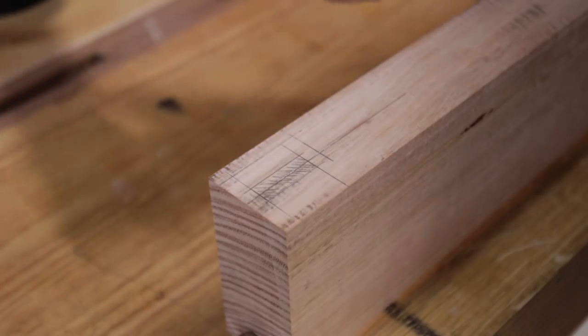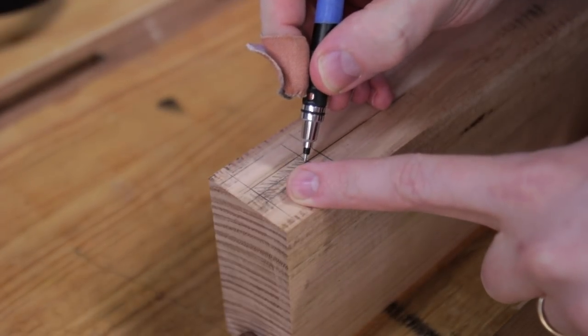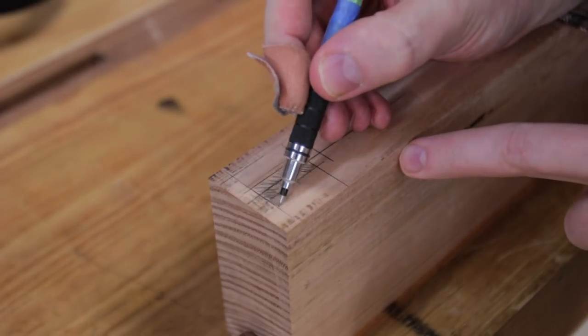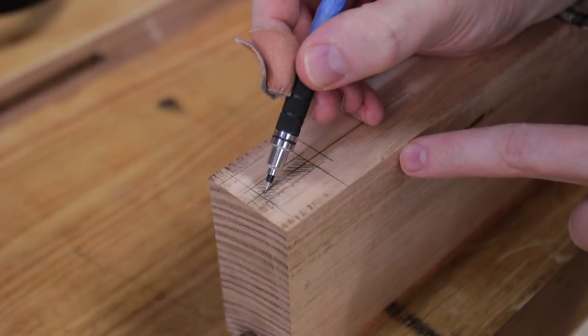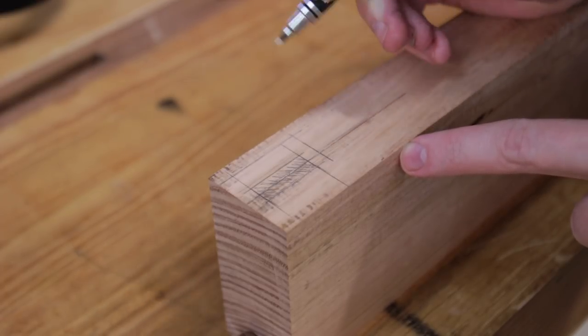These are a little bit more expensive than a standard straight cutter, but nowhere near as expensive as a spiral upcut bit. For this demo I'm going to be mortising this piece into this piece, using a 3/8-inch spiral upcut bit. I've got my centerline here, which is what I've centered my edge guide onto. This is my start line and this is my stop line — I'll plunge to full depth at those two points, then work my way through the rest.